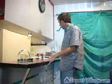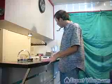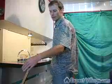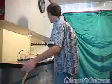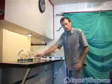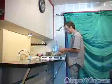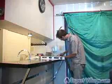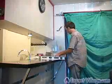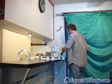And then if it's off on the very end where it is attached to the wall, you're going to have to actually knock it loose from the wall just a little bit. What you want to do is just take a knife and cut along the edge to make sure that all of the caulking is cut loose. And this is only if you have like a raw bar top that you're going to do something else with.